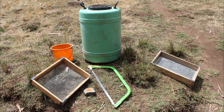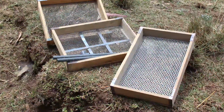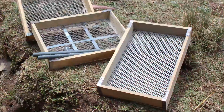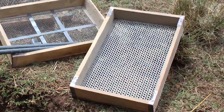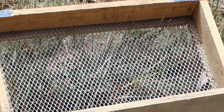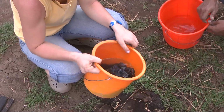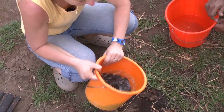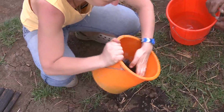Christina now explains to us how to begin making your filter. The first thing is to gather the materials of the gravel and sand and a mesh or a sieve that can be used to sift the material in order to separate the larger gravel, the smaller gravel, and then the fine sand. So we want the 1/4 inch, the 1/8 inch, and then the fine sand, which is 0.15 to 0.35 millimeters. And the next step is we wash both the gravel and the sand with clean water, and that removes some of the bacteria, the sediment, the silt.